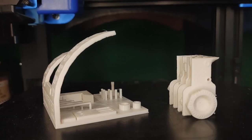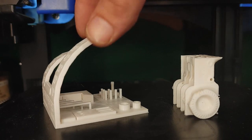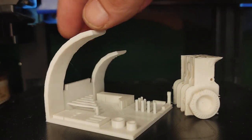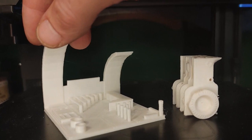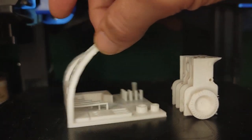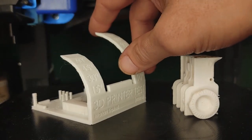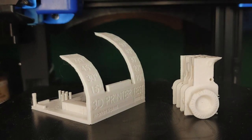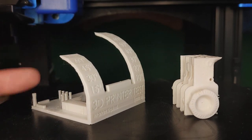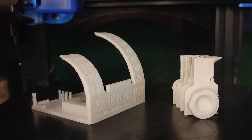Now that we've discussed our settings, let's discuss our models. We did an engine benchmark test and a 3D printer test — the small version of a multi-function test — so there are lots of different things we're gonna be looking at and comparing on the two models. The important thing to note is that those settings are gonna be the same for both printers, and that is going to lead to some interesting differences, notably in the one setting I didn't alter between the two and probably should have, which is retraction. We'll talk about that more when we discuss this machine.